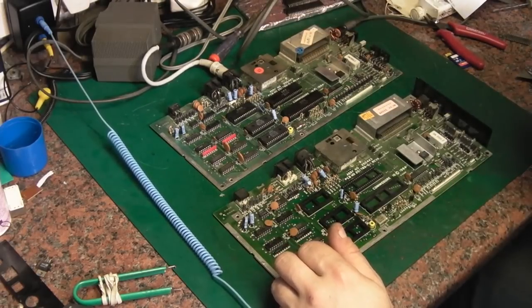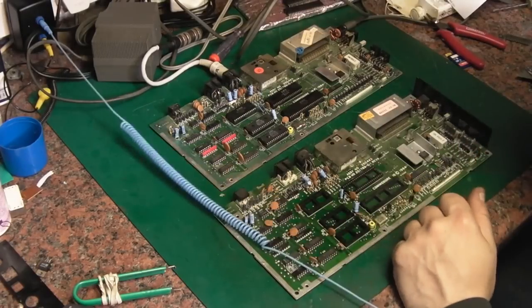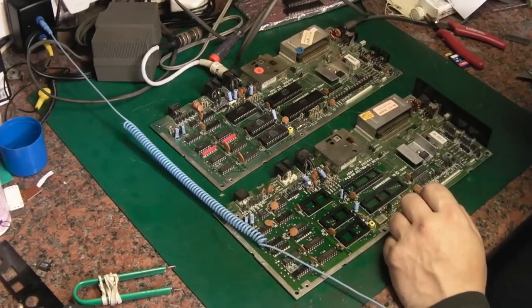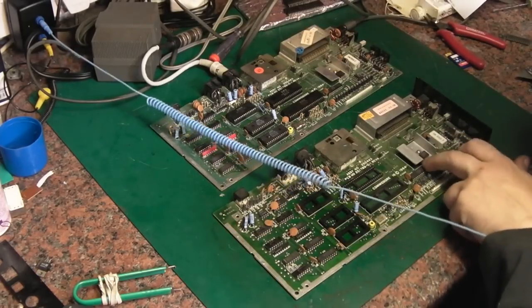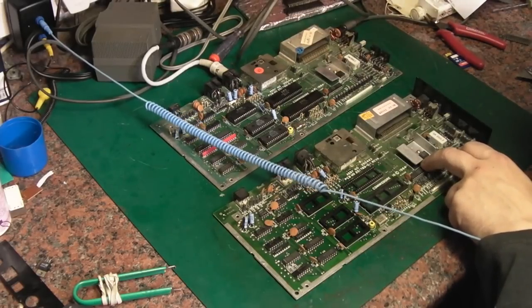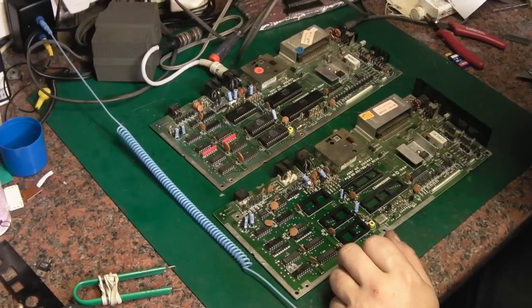In the next video, we'll do a recap on this board. So we'll take that off, that off, that off, that off, that off, that off. We'll test them actually and see exactly how bad they are, but we'll put new ones on, obviously. I think we'll socket the RAM up, and I think we'll socket that up there. I don't know if I've got a replacement for that. I may have in some of my stocks, so I'll have to hunt round for that. Like I said, we'll whip the RAM off, and hopefully we can test the RAM using my other tester. Hopefully, and we will take it from there.